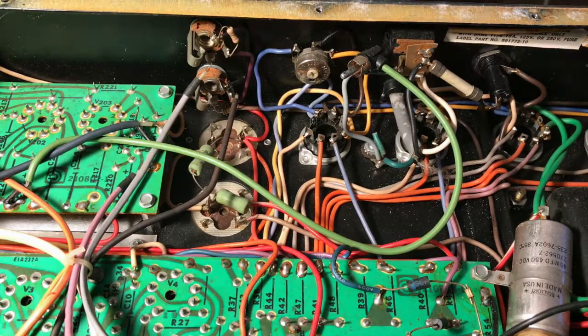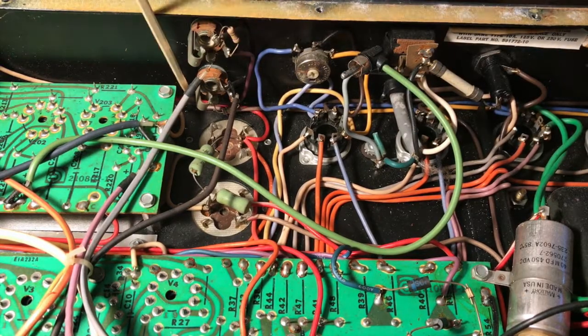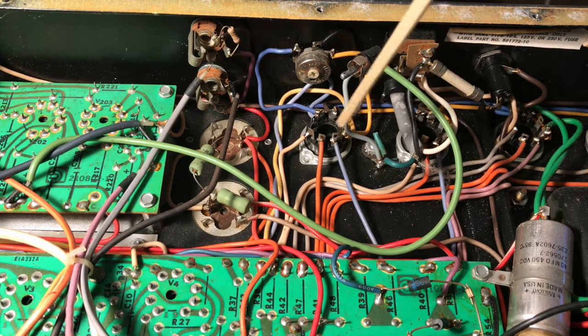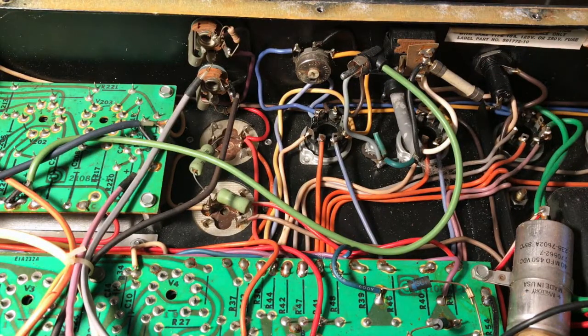That wire is coming across here, that's this wire. And if you look, it is tied in to one of the cathodes of the output tubes. And so far we haven't seen the chassis. There are several other lines, however, connected to this point. This is pin 8 on one of the output tubes. Here are the 4 output tubes here, the 7027s, which are similar to 6L6s.